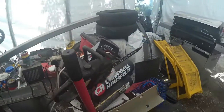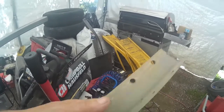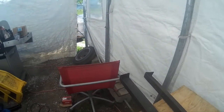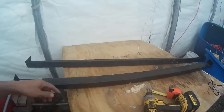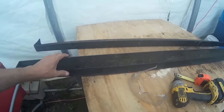The frame on that is about as thick as this. I think it's a bit less than 1/8. Well, this is 1/8, but that frame is thinner. And I'm worried that I'm going to just blow through it with the welder and nothing much to hang on to. So by drilling through the side and this side, see, that's going to be like this.